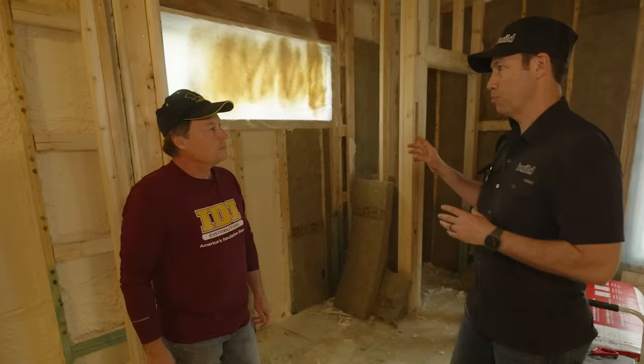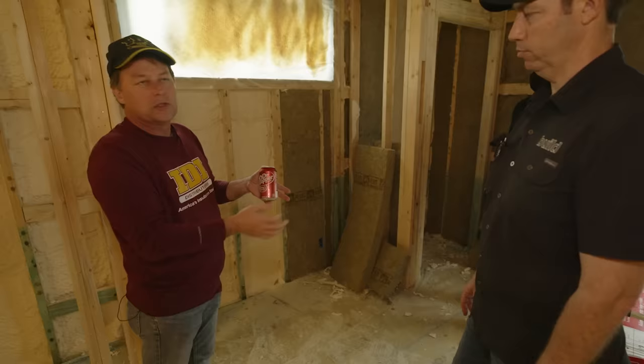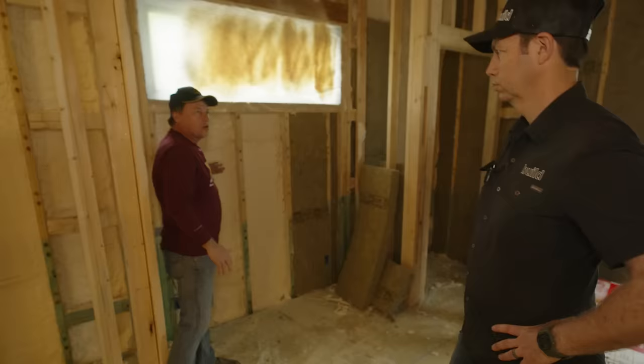Okay, when we get to the Batt portion, the first thing we need to make sure of is that we have enough insulation behind the plastic. If I pull this out of a cooler, this is a vapor barrier. Yep. It's metal, could be plastic. What you see happening on here: condensation. Yep. So plastic's no different. We've now got a layer of plastic here. So the first thing I need to do is make sure that I have enough insulation behind my layer of plastic in order to not condensate on the surface of this.